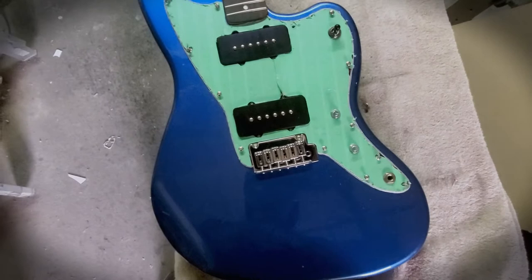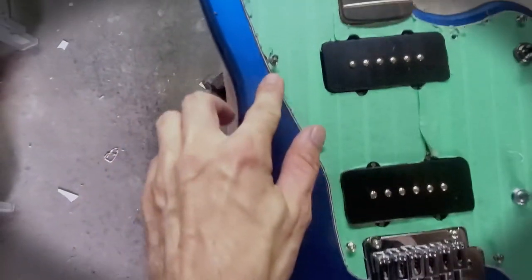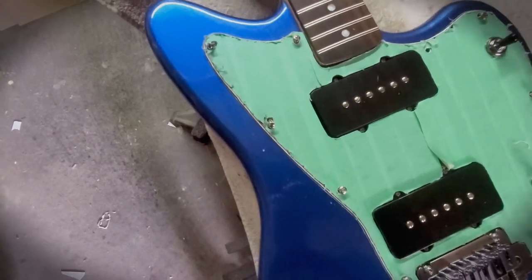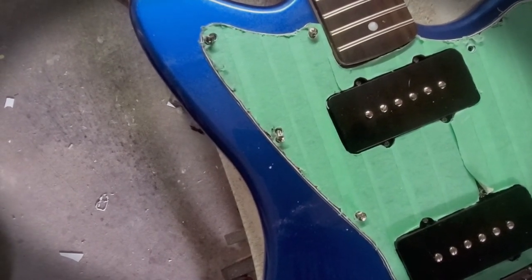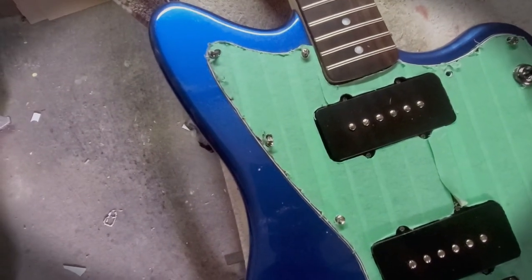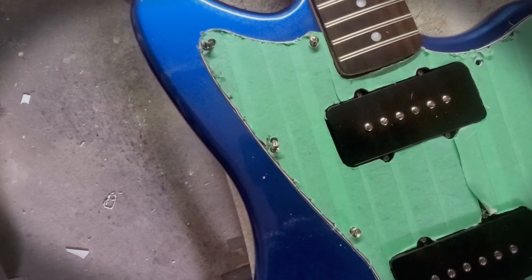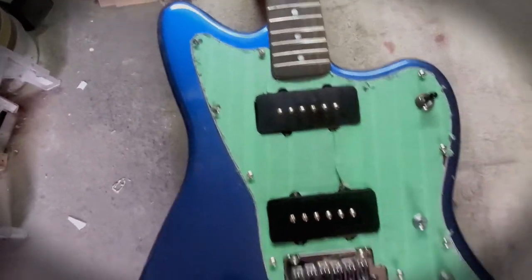Here's the dry fit - tape is still on there. Just a couple screws - this one here, this one over here, and that one there - they didn't quite line up 100%. What I'm probably going to do is put a toothpick with some wood glue in the original holes, because when I drill the new holes it's probably going to overlap the old ones ever so slightly. Obviously if I do that as-is it'll just create a much larger hole that won't hold the screw. The toothpick with wood glue puts some meat back in that hole, and when I put the screw back in it'll have something to hold onto nice and firm.